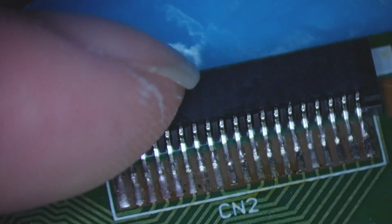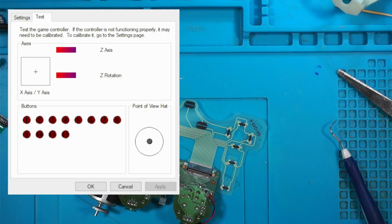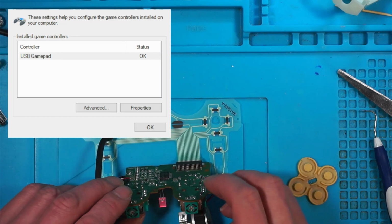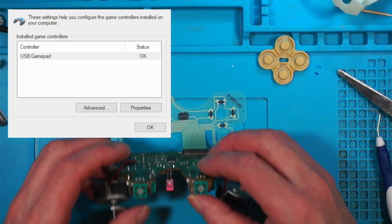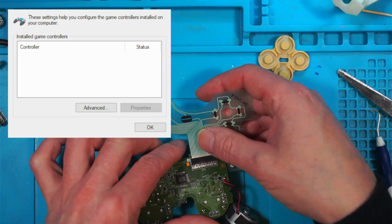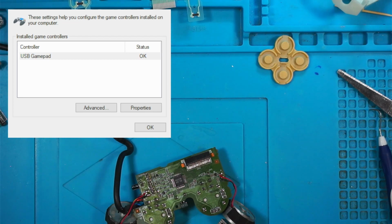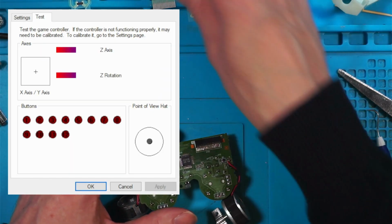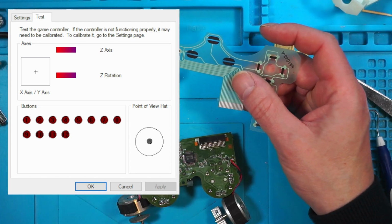Let's test for loose pins. That's all solid. Right, have I got that set up the right way? I've got my analog. Do my sticks work? Sticks don't work. So there's a different issue with this one. So there's something different going on in this one. Well, that's interesting. Let's turn it off. Pull this back out and see if we get a different... So we've still got nothing. Obviously I've pulled the buttons out, but it's a different fault to what we had the last time.